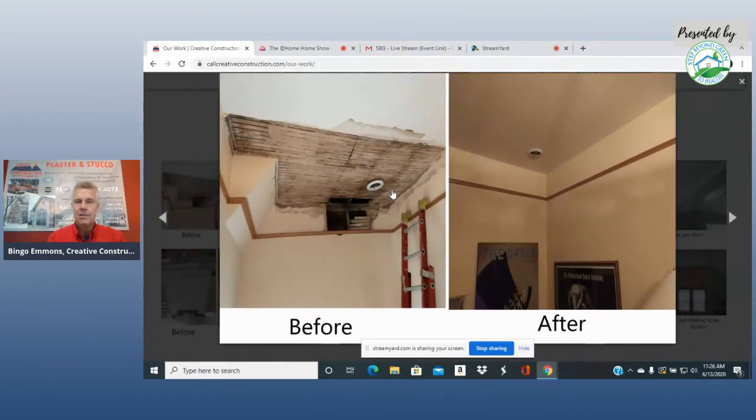And if you look in the back corner there, there are some studs. People are like, oh, I'll just stick a piece of wood next to it, it should be fine. Don't ever try to use bad wood or wood that's been wet, that got wet in the rain or whatever, because of the mold and stuff. As you see on a job like this, Randy was just on a little while ago. This is what happens when the roof leaks, and after Randy fixes the roof, then I come in next.